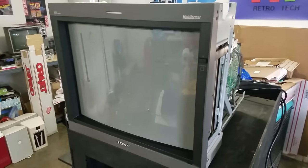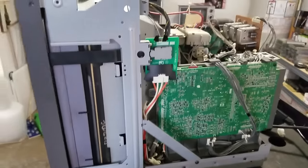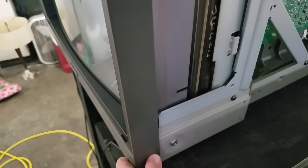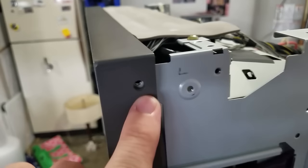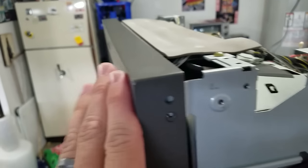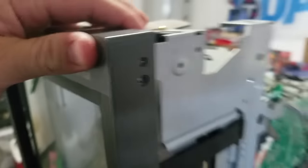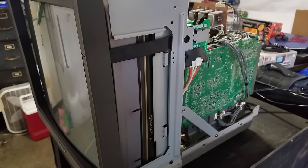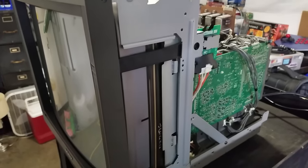We're looking at the 20L5 — I've picked the camera up and will walk around it. You'll notice we've taken the back shell off, which is pretty standard. The bezel has screws here and one down here. To get that outer shell off, you do have to take this one screw out, loosen the bezel, and then slip your metal out from behind. You need to take that off on both sides at the top.